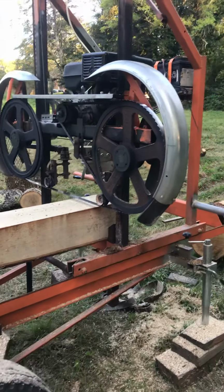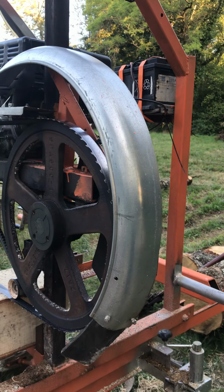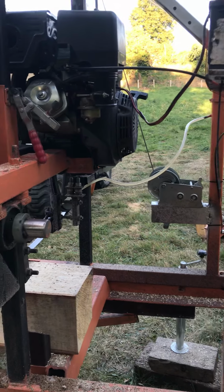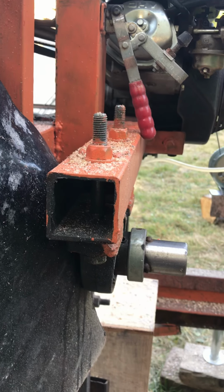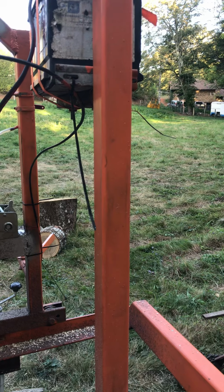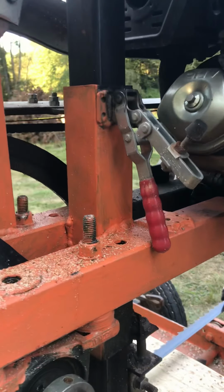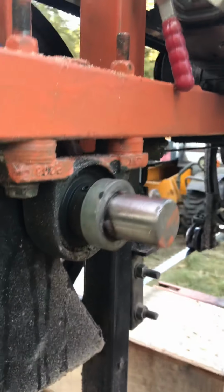If anybody's interested, I can certainly give you some pointers on the best way of building one, but the top and the tail of it is I went with a 4-post design, a bit reminiscent of the Woodland Mills, I guess. It's basically 60mm box section, and if you buy the 60mm in a 4mm wall, the 50mm box will slide up and down in it absolutely lovely. So that's the first port of call. And second is obviously some decent bearing blocks, something decent for your shafts.